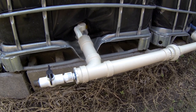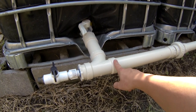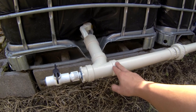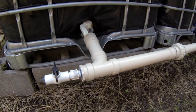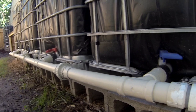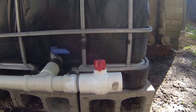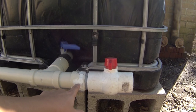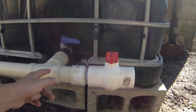One thing I'd like to mention about the PVC parts I used: these are not for a pressurized pipe or pressurized unit — this is just for flowing water. The difference is they're much cheaper, probably about half the cost of a PVC T that's for a pressurized system. On this side I have a dump valve — a two-inch PVC valve threaded on both sides. This is not needed; I just happened to have it. You can put a cap here instead, or use a 90 instead of a T and you'd never have to worry about it.